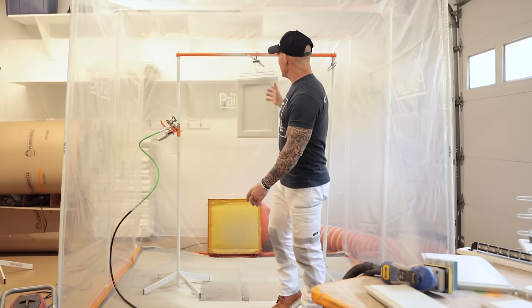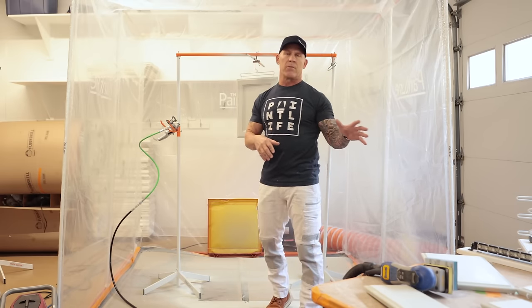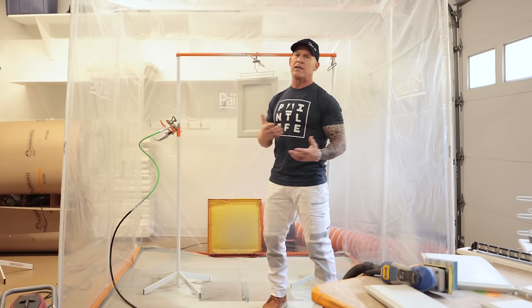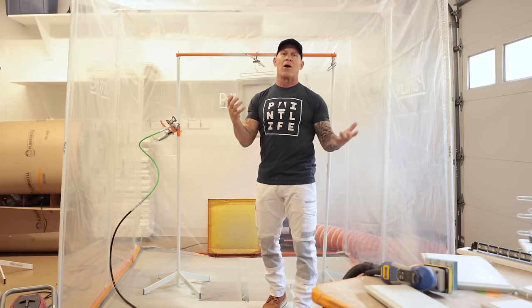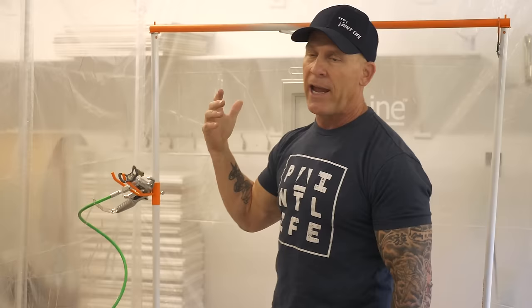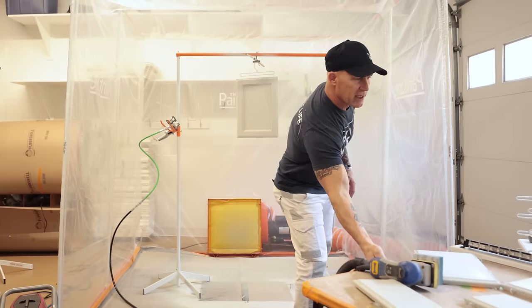Okay, now we've waited 16 hours. I'm going to do my final inspection of these cabinets on my inspection table and do any last aqua coating if I need to get rid of any more grain. Some of that's gonna be customer expectations. You know, how much grain do you wanna see? The cabinets are looking pretty amazing, but I'm gonna do my final inspection and final coat, and I'm gonna be spraying, hanging up right here on our PSDR rack. So I'm gonna get my inspection table over here.